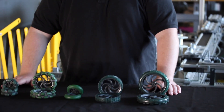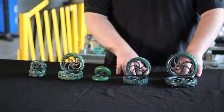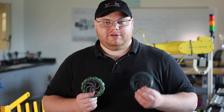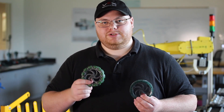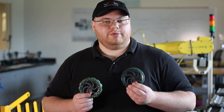In most cases, your robot is going to want some combination of both high traction and omni wheels. Most of the time you'll want to drive your high traction wheels and let the omni wheels spin freely — this lets them move as needed to reduce friction when turning. One thing to keep in mind is that if you're only driving your high traction wheels, your center of rotation is no longer the middle of the robot, but instead the midpoint between your two driven wheels.